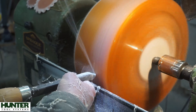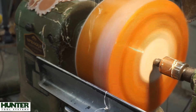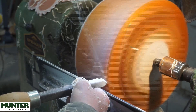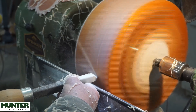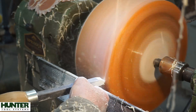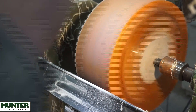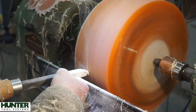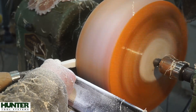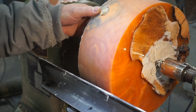That was a real-time clip — I like to leave those in there. We're using the Hercules from Hunter Tool Systems, and really three or four passes and this thing was trued up. That divider method really works well. If you've got one of those clear round center-finding jigs those will probably work well too, but the divider method is a cheap way to do it and most turners have large dividers like that. Give it a try if you're not already using that method.